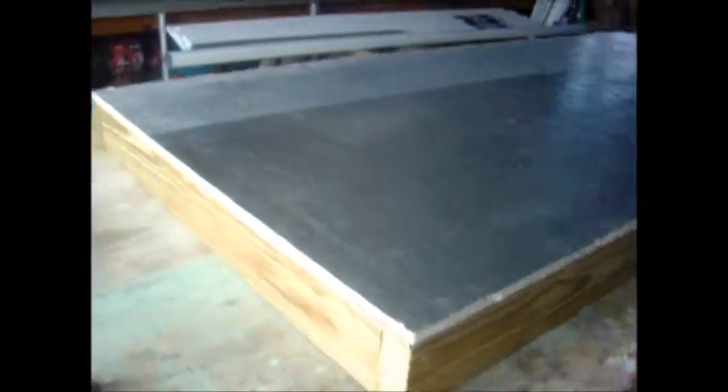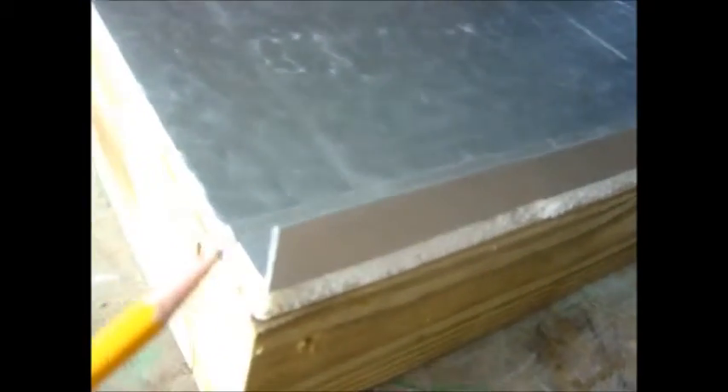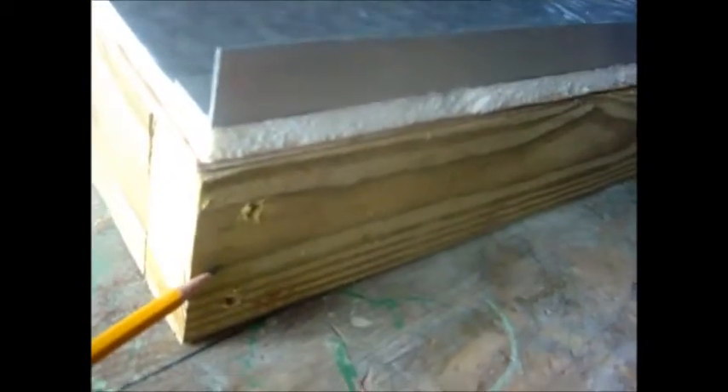Here's the basin frame, plywood and foam, all glued together and ready. We're ready for the sides to start — the sides will be PVC board. The height of it will be set by how this aluminum edge sits, and the glass will be underneath. I want the PVC board to be about an eighth of an inch higher than this edge right here. It's going to be 3-1/2 inch PVC board going all the way around. I'm going to put the ends on first, flush with both ends, and then put the long pieces on.